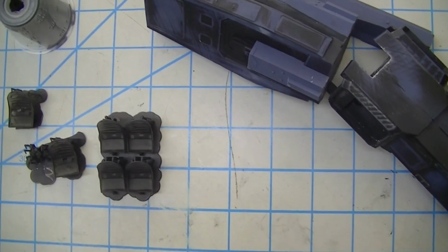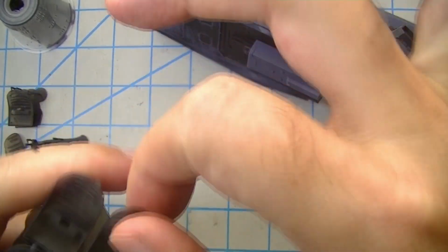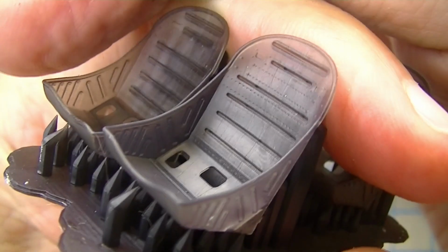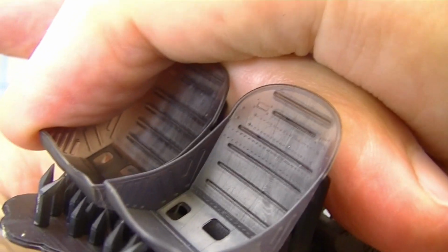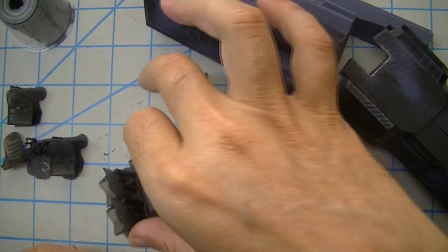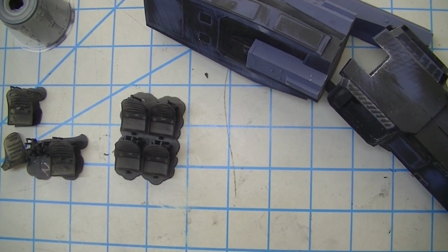Anyway, as I was saying before my card ran out of space, you can see that there's some really fine detail on these parts. The back of the seat, hopefully you can see those, has some rivets there, and those are down around 0.15 millimeters in diameter and depth. So that's really pushing it for just about any machine. The part that's actually in the model that I showed you was printed on a Form 3, which is about a $3,500 machine, and it's laser driven as opposed to being a masking LCD type printer. But anyway, what lessons did I learn here?